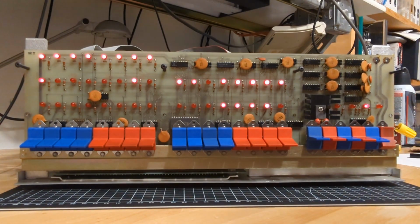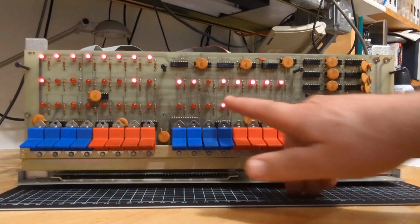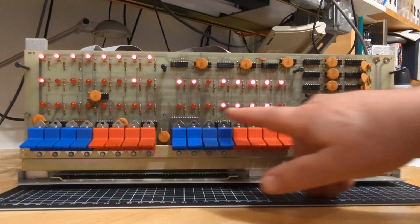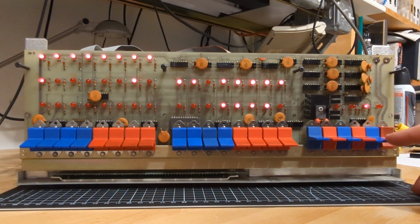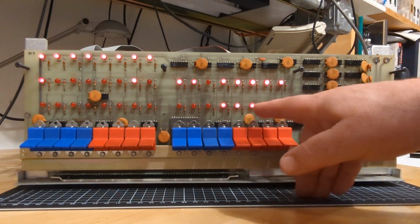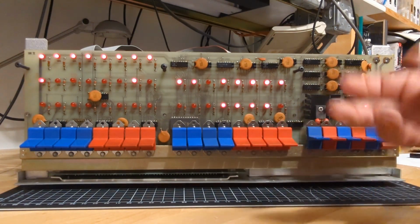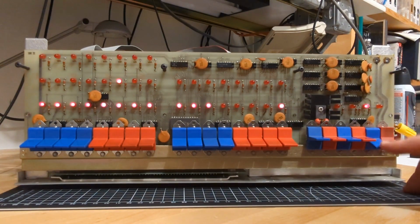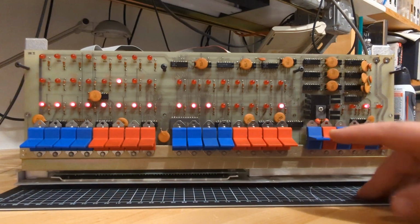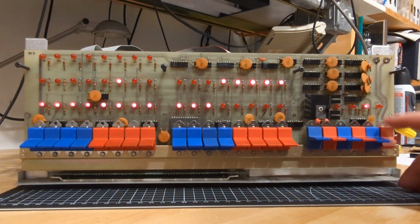which are two different data directions while we are running our little test program here. So let's verify the return address comes out right. See the address of this thing here? What do we got, a 1E in hex, because this bit here is a 0. It should return to 1F, or that should be the return address it pushes into the stack. And that is, I believe, what we saw in there. So when we see it pushing into the stack, we got a 001F. So all this jives.